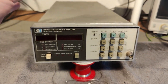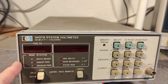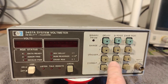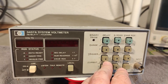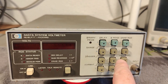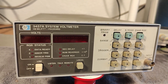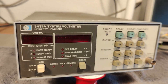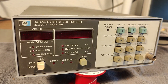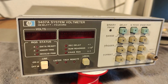It is IEEE, and there's a really special feature about this voltmeter: its time trigger capabilities. It can trigger on external events or different things. If you use an external trigger input, you can sample in time exactly what the voltage is, and it is microseconds accurate doing that. I found a very good video that demonstrates exactly that feature — I will put a link in my description. It is made by Greg, so please have a look at that video if you want to see the time trigger feature.